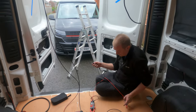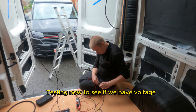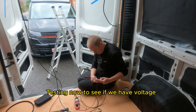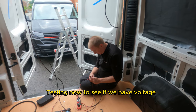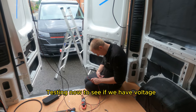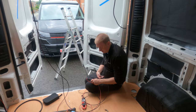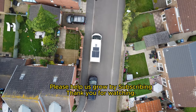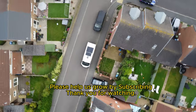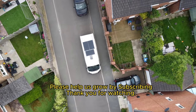Just testing to see if the solar panels are working now. We're going to stick a probe on that wire. On this one they don't have much copper showing because we've chopped them off, but we're getting 24.5 to 24.9 volts.